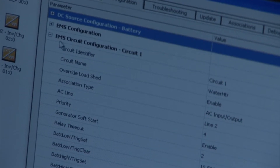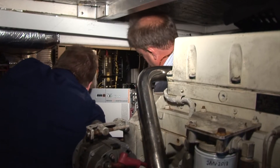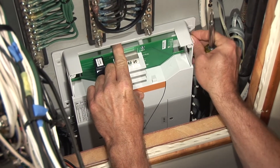We need to make sure that you've got a backup system to where we can drop non-critical loads like a water heater or the second air conditioner. They're putting too much load on their normal generator, which will decrease the life of that generator. It is not practical to install a larger generator. It is very practical to install a battery bank and an inverter and sequence or shed some of those loads off to the inverters.